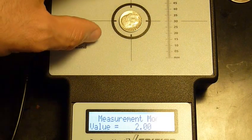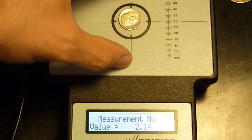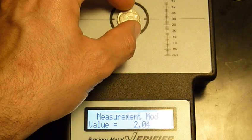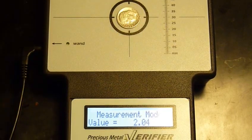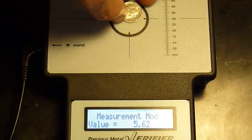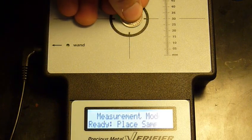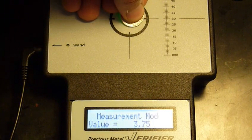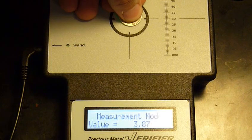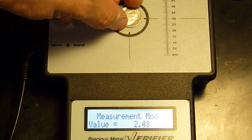It's very close. You have to get it within the circle here — these are actual references to where the sensor is placed. You have to have that spatial alignment: the axes have to be aligned perfectly for the center of the coin in the X and Y. And also even the Z, because if you start bringing this thing further and further away, it's going to be less and less accurate. I've got it at an angle, holding it up slightly, and it's at 3.9, 3.89, 3.87. I bring it closer and lower, and it gets more and more conductive.